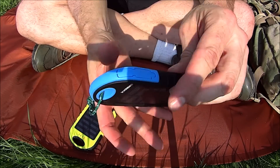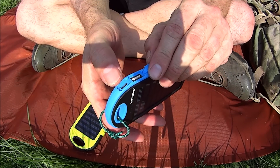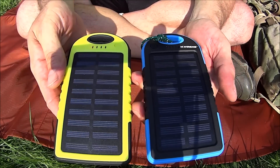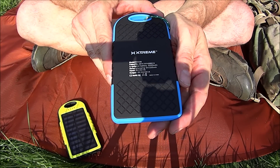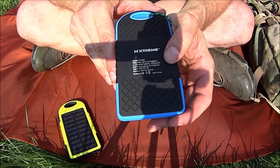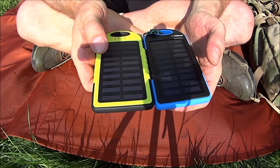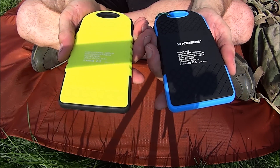You have two USBs: a standard USB outlet and a micro USB inlet, plus another USB outlet. You've also got a solar panel. This one looks a little sparser — the solar panel is listed as five volts at 200 milliamps, which implies a one-watt panel, but looking online these panels look more like 0.8 watts, five volts, 160 milliamps.